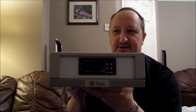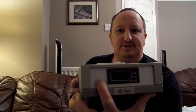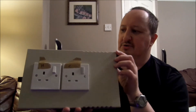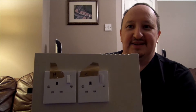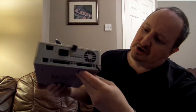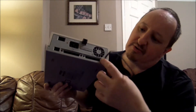We're a couple of days later from my first video, but I finished it. There's my box. You can clearly see I've mounted the STC-1000 in there. The white stuff is just a piece of plastic lid off some trunking — got a hole cut out, job done. Cut two holes out on top — these are just temporary hot and cold indicators. I couldn't use the original off switch because it was integrated into the power supply, so I've had to mount an IEC connector on the back. And there's the thermocouple wire going through that hole — should be plenty long enough.